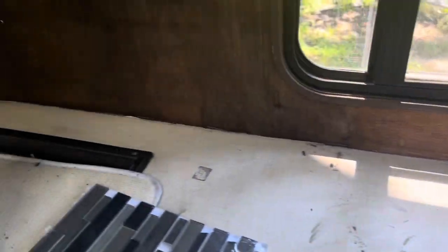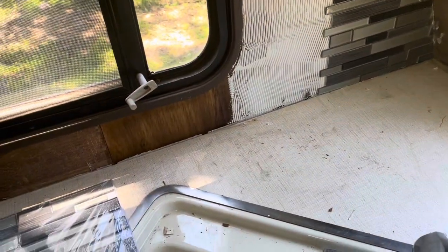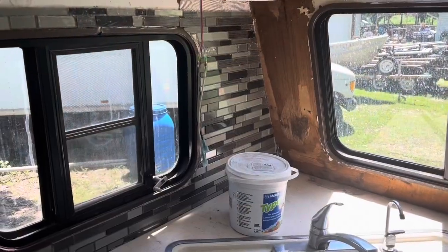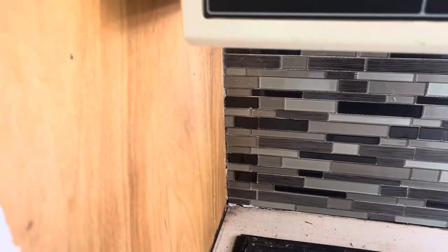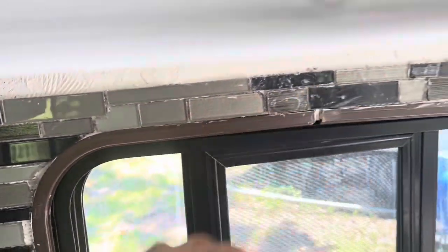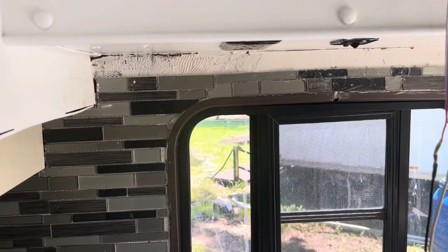This is where I really like using sheet tile for going around small spaces — I can measure up to the height here, just cut this off, and go ahead and lay that tile on there. Fill in the little spot, which is a whole lot easier than trying to cut a big swoopy piece and figure out what to do with the waste. We are cruising along with the tile installation — you can see all my mistakes, but hey, it's a camper. I ended up out of plane; I had to fix it right here to get everything back on track to the same level.